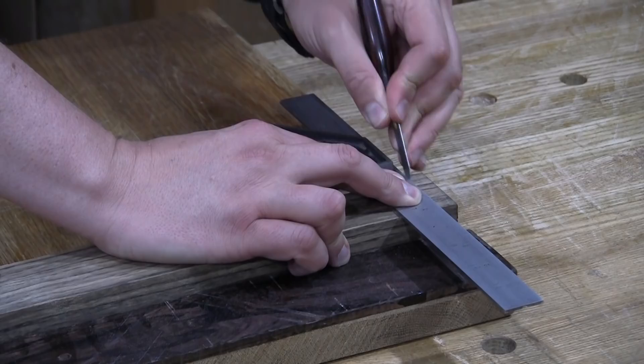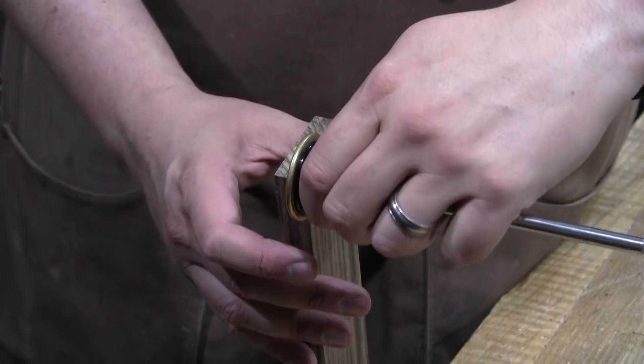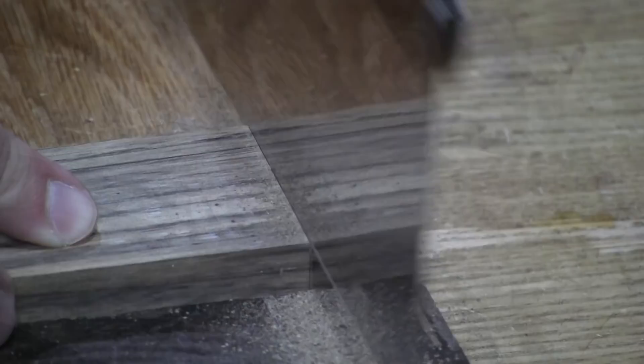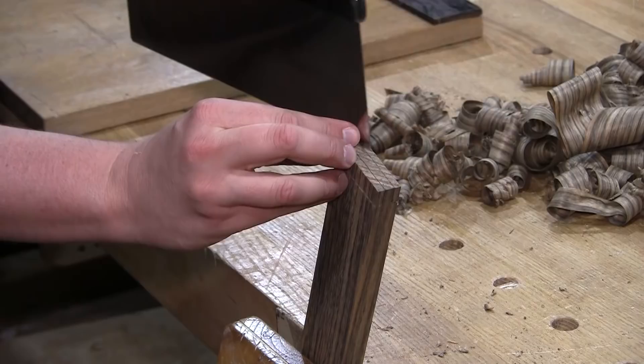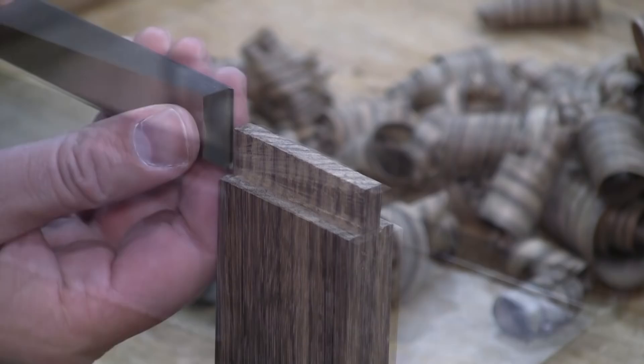Speaking of which, I can use my square and a pencil — or if you have an exacto knife, you can mark out the shoulders. I'm going to have half-inch tenons on each end of these boards. Now with my wheel gauge I can lay in the shape of the tenon itself. Then using my back saw, I will saw out the shoulders of the tenons and saw the cheeks of the tenons. We have tenons. Maybe your tenon doesn't fit right off the saw — no big deal. That's why this wide one-inch chisel is in the tool kit, because it's perfect for paring tenon cheeks and getting that fit just right in the mortise.